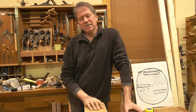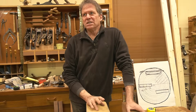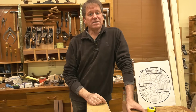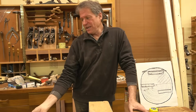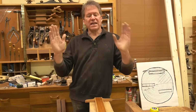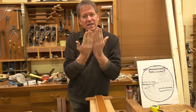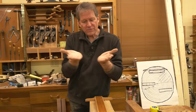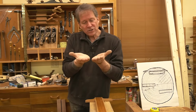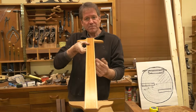Do the more growth rings help the board not warp? It can still, but I have found in working with old growth, it tends to be really stable, especially, it's more a factor of how you cut it. Like plain sawn is less dimensionally stable because the trees seasonally expand and contract along the line of the growth rings. So if you think of the growth rings lying in plane with the top of the board, those are going to expand and contract more than if the growth rings are oriented perpendicular to the top like this straight edge.